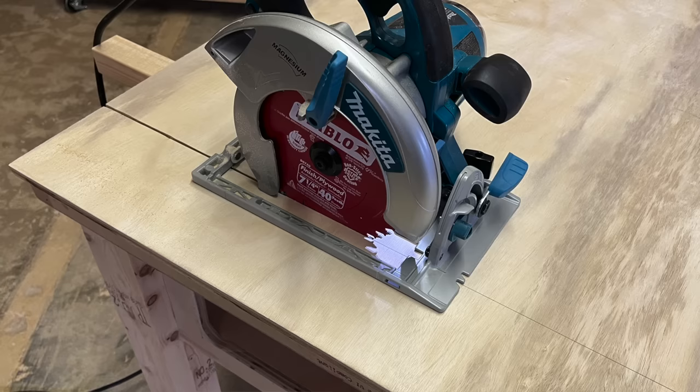Here are quick tips for stopping cleanly. First, don't move the saw — come to a stopping point, take your finger off the trigger, and let it wind all the way down. Keep both hands on it until it's done and don't jostle it — a saw slowing down can kick very easily. When it's fully stopped, take your hands off without budging it and leave it exactly where it is; it's perfectly lined up in the kerf and one bump can lightly twist it. When it's time to cut again, carefully put your hands on the grip, back it up just a sixteenth of an inch, then hit the trigger and let it spin all the way up. Try to get the front tooth edge to hit the exact same cut line it already made — keep splitting that pencil mark in half.